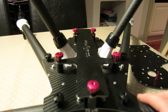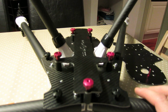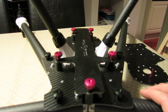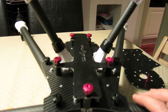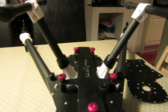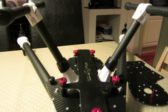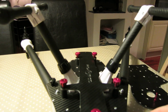And for this octocopter you need big batteries. I'm gonna use 4S 13,000 milliamps to have what I think will be a reasonable flight time. I'm very interested in testing that out, but these batteries will have to fit back here, and I'm also thinking about how I'm gonna place them here to have the right balance in the helicopter.